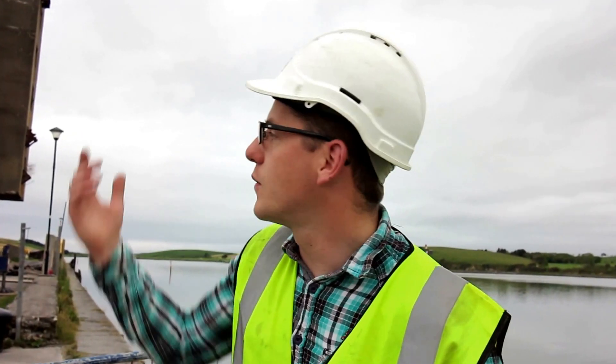And what do you do with the debris — what's left? We have an on-site concrete crusher. The building comes down, the over-spoil goes through the concrete crusher and it comes out as fill material. There'll be a layer spread across the site as a finished surface. Everything should be left on-site. It's really a support material.